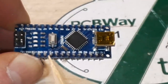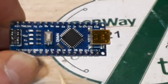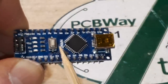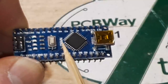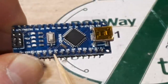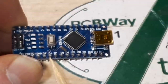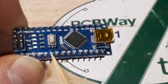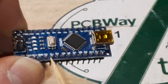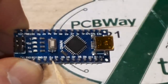That applies to the PWM — pulse width modulation — pins. I think there's six of them on here. They allow you to fake changing the voltage by rapidly turning the signal on and off so that you get an average voltage. So let's say we want our light to turn on but only at half power — we would set it up as a PWM output at 50% duty cycle. So 5 volts at 50% duty cycle gives you 2.5 volts.